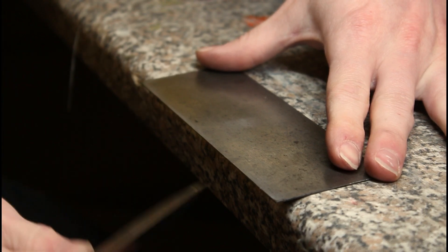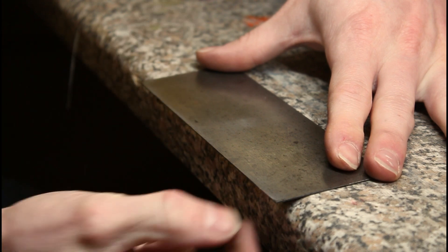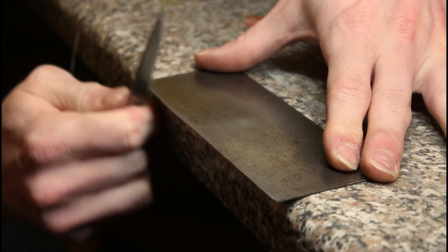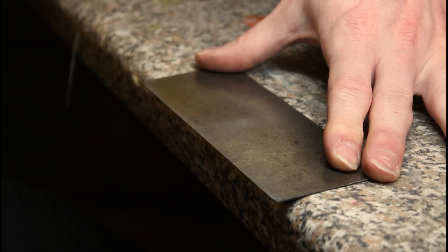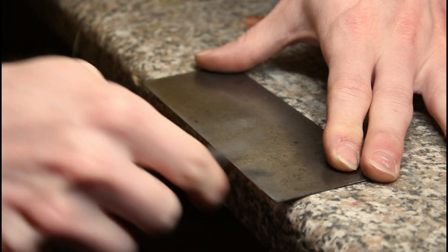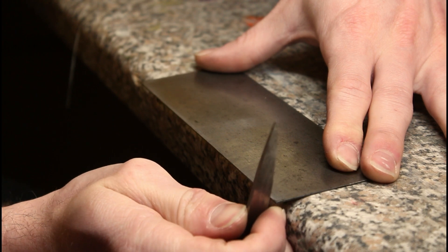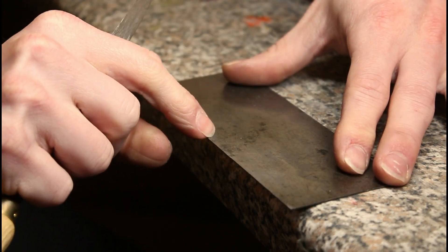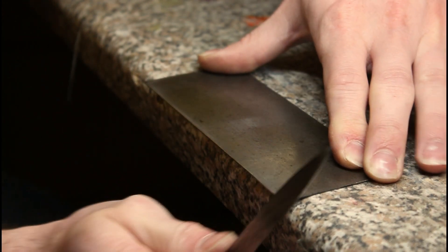This next part is what you're gonna need to practice. Using the burnisher, you rub the edge in one direction — that creates a burr on the downward lip. Then you rub the same edge in the other direction, which moves the burr up onto the edge so you can feel a sharp burr along there. That burr is what does the cutting. My advice: just do one pass each way. The first pass needs quite a lot of pressure; the second pass less, because you've already created the burr. You can sharpen both sides.